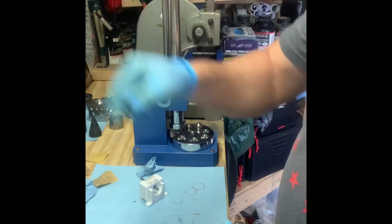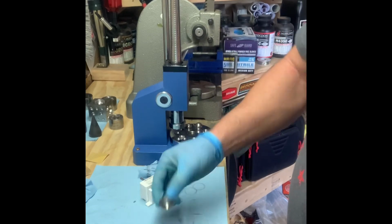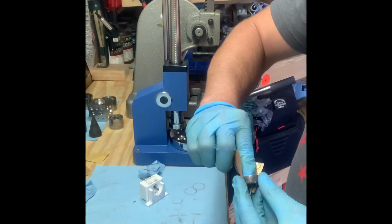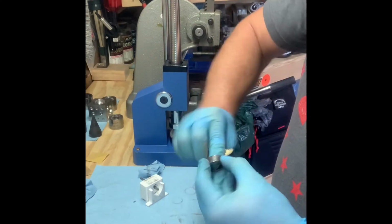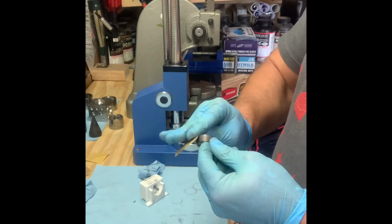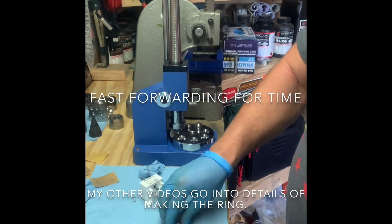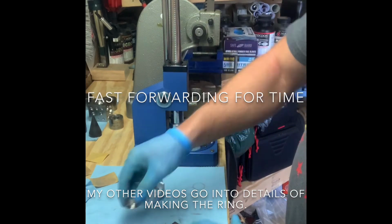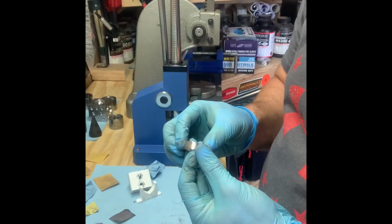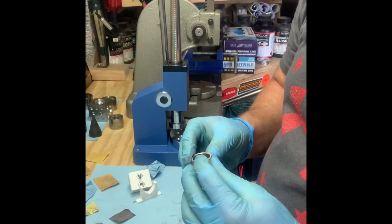The only difference is really always a consistent size, and you want to make the rings then shape it into the heart pendant. So. All right, so I've got this. Great. And the inside edge and the outside edge as well. I'm going to go back with 600 grit, just to smoothen it out a little bit more. Make sure all the lines from the half round file are gone, inside edge as well as the outside edge. All right, once I've got the ring how I want it, pretty close to finish, it's pretty good.